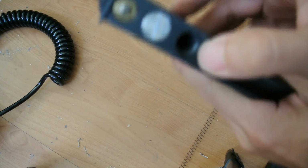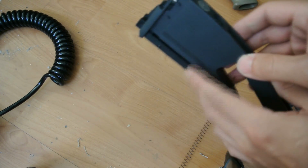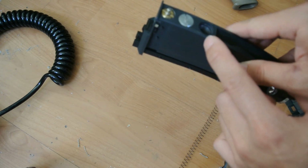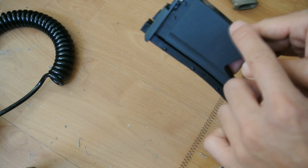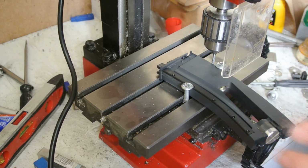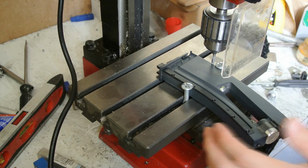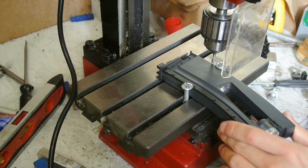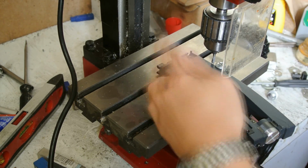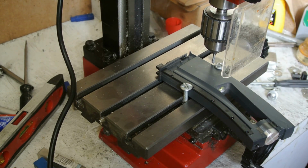Open this expansion chamber here. So now what I'm going to do, I'm going to use a milling machine and take an end mill to cut this through smoothly. So this is not the correct way to mount this for the milling, but it's pretty secured, pretty tough, and it's just aluminum and plastic, so if I go slow I think it will be okay.